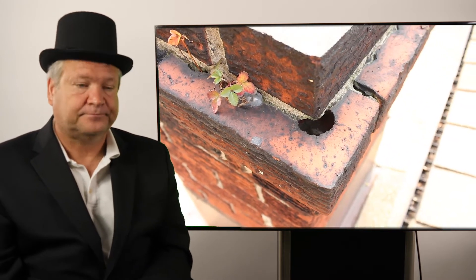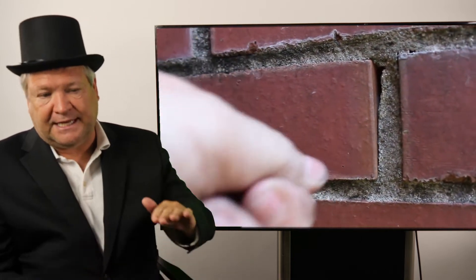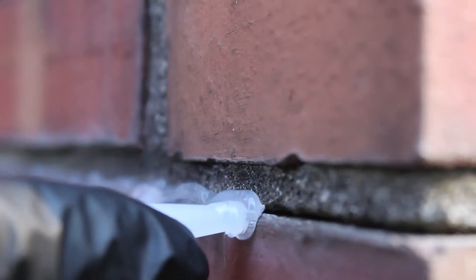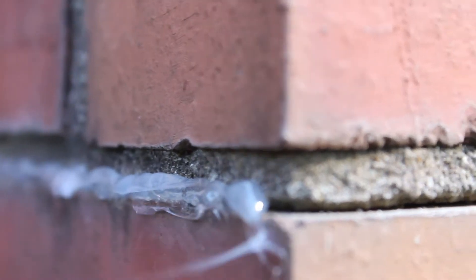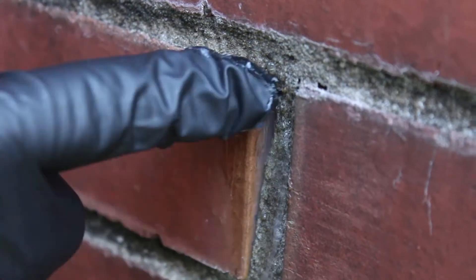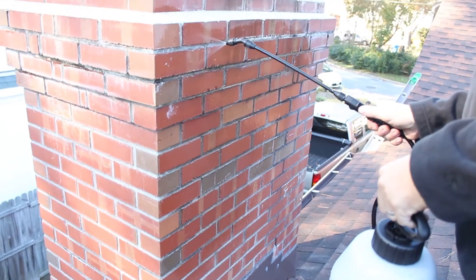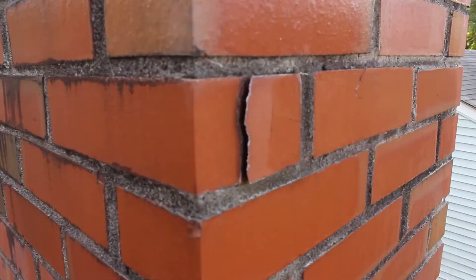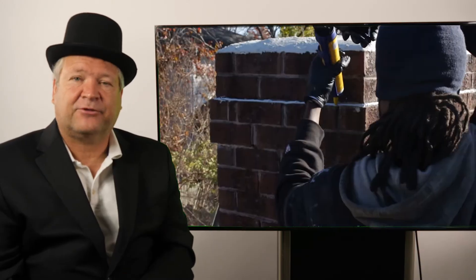So what do you do? Clean up all the brick holes, wire brush off the chimney, fill the brick holes with new mortar, and then apply an elastomeric sealant over the top of the drip edges. That way it bonds to the brick on the inside and the lower drip edge — water hits it and can't go inside the brick hole, it goes to the outside. Having drip edges fixed usually costs about three to five hundred dollars.